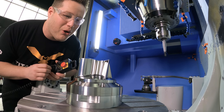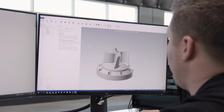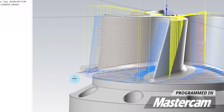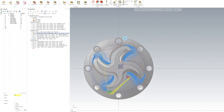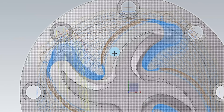I can't wait to get this part over to quality and get it inspected. To start the roughing process, we're going to use Dynamic OptiRough. I've dropped down three inches for the first cut and I've got a step-up strategy of 50 thousandths all the way to the top. Now this toolpath can only cut what it can see from the top plane, so that means the undercut on this wall is not going to get cut — it's going to be left vertical.